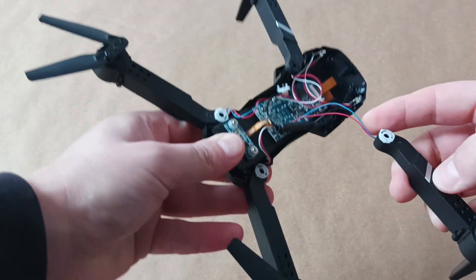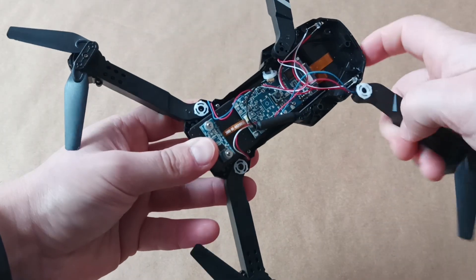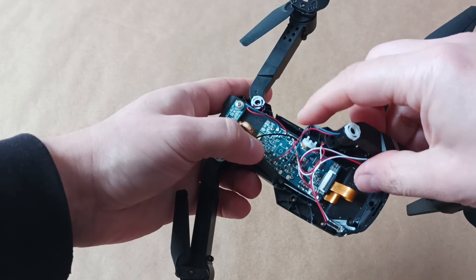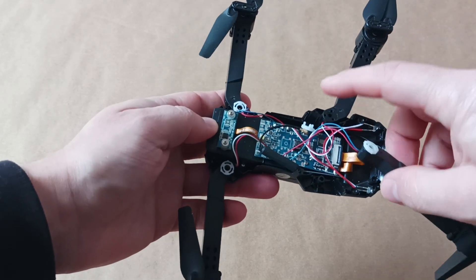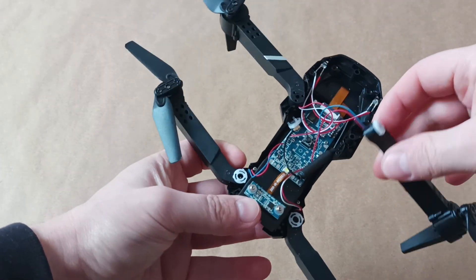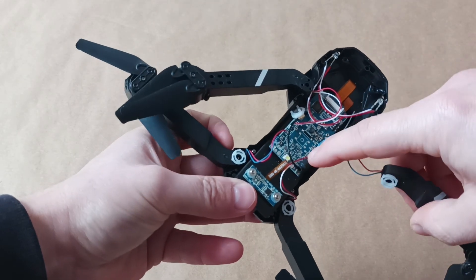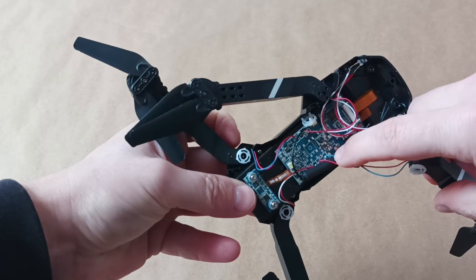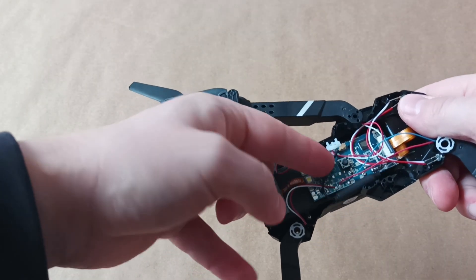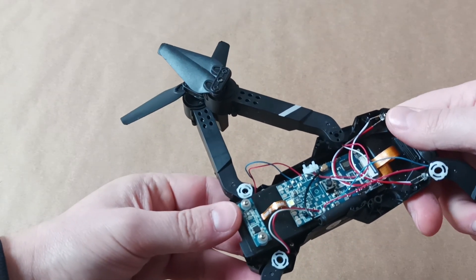All arms have cables that go through them up to the electric motor inside. Here I can see that these cables are soldered to the circuit directly, but other drones may have plugs that plug into the circuit. This setup is not a very comfortable one because if you have to change the arm, you'll have to solder it back, and it could be a difficult operation for those who have never done that. Also, these circuits are so small that soldering on them is difficult as you can damage some other contacts on the circuit if you don't know how to solder small parts.